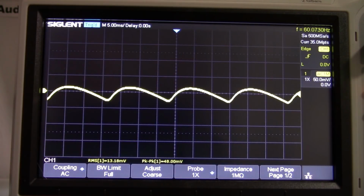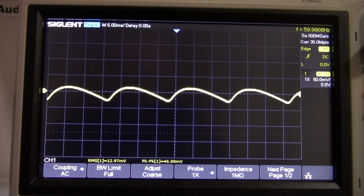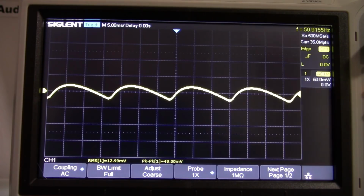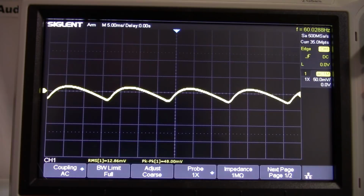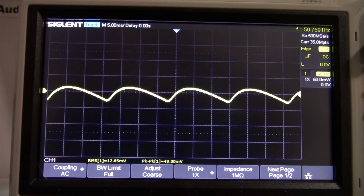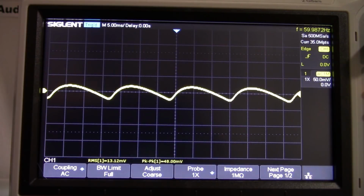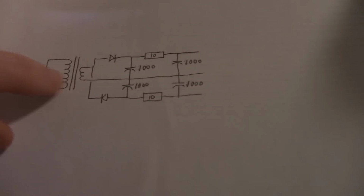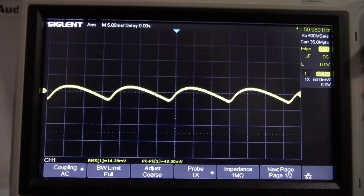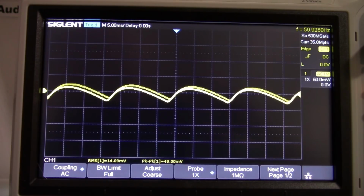Much better supply. Now I know a lot of you are now screaming or shaking your heads and saying, John Audio Tech, why don't you just use a voltage regulator? Well, yeah, those are good. They're going to get rid of your ripple, that's for sure. That would relax your requirements for capacitors. However, I still think feeding the voltage regulator a signal that doesn't have those high harmonics in the signal, using that pi network, as they often call it, the resistor and capacitor filter there, would greatly help the regulator out, giving it a very clean supply.